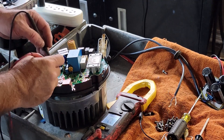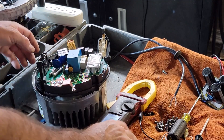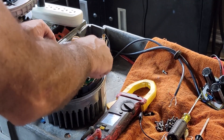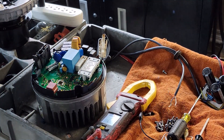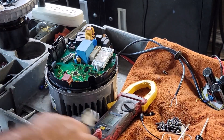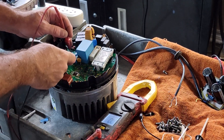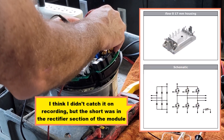Go back to continuity — they're open. But if I go between leg and leg on the fuse on that side, it's dead shorted. With the reactor out I think we're open from this, so I don't think that's shorted. Let me cut out the MOVs — I'm just gonna read it again and see if it's still shorted. Not the other one.